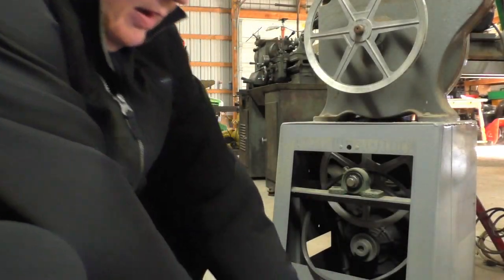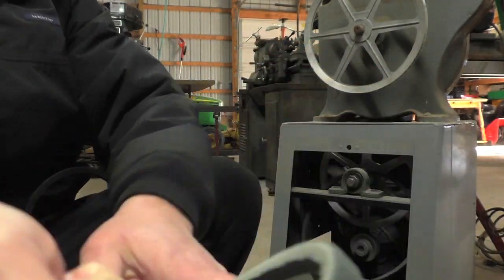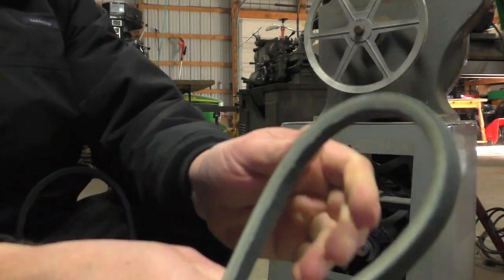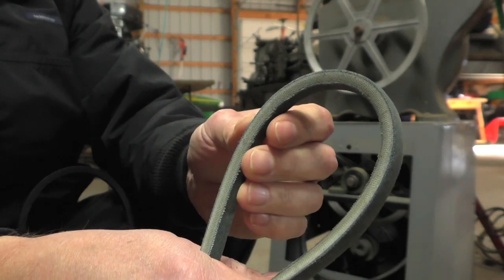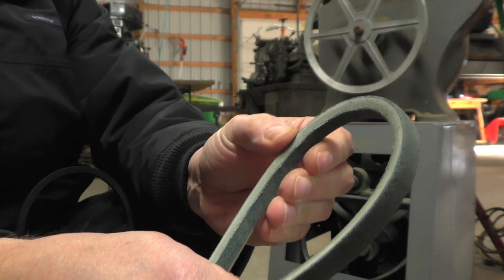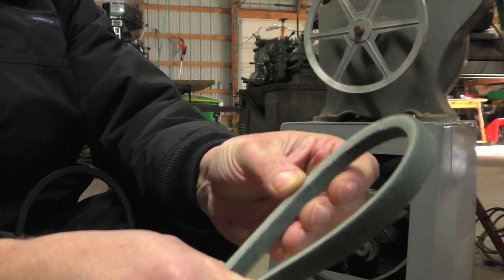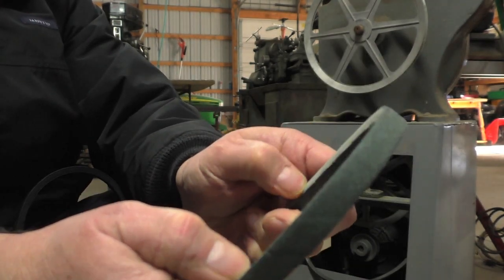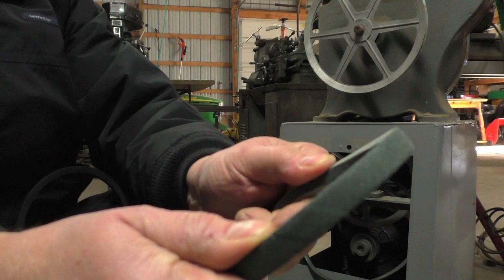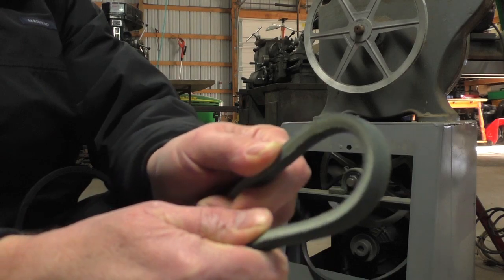Okay, I have traded. I had this belt here, which I guess is Kevlar coated, and this is a belt that one would use in a lawnmower to drive a riding tractor when you have triple blades and you're gonna drive at 3,000 RPM and those blades are gonna whip around, so heavy, strong stuff. But I feel like this is slick. It may be tough, but it's not grabby, and maybe it's not having a good time going around that two-inch pulley that's there.